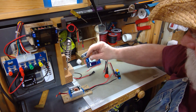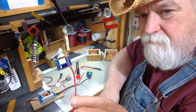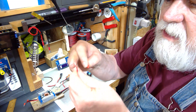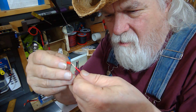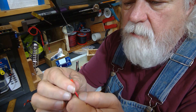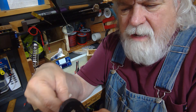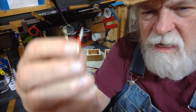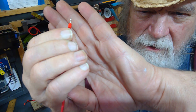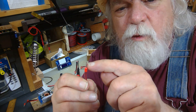To make a ferrule, use your crimper. Take a piece of wire, strip it back, and I usually twist the wire just a little bit to get the ends all together. Then slip your ferrule directly on there until you can see the ends of the wire — if they stick out, you can trim them later. Take your crimping tool, open it up, put the ferrule in the hole, make sure your wire is in place, and squeeze it down. You'll get three crimping circles on it — a nice solid connection.